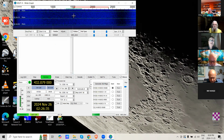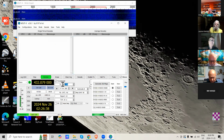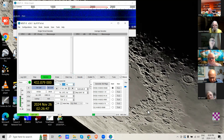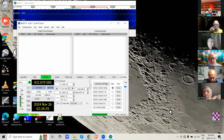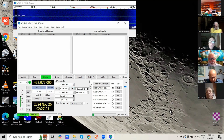I wrote there, right? You can also type it right in here. 1500, enter. And now I'm listening at 1500 and transmitting at 1500. So that's where the guy was, 432.079, but the smart people in the class will be thinking to themselves right now, what about the Doppler? You ain't got no Doppler.